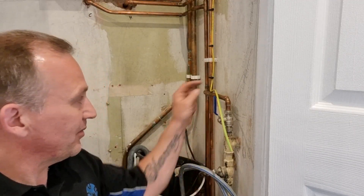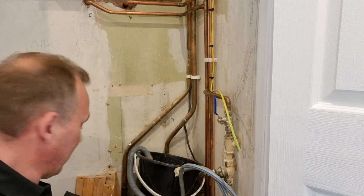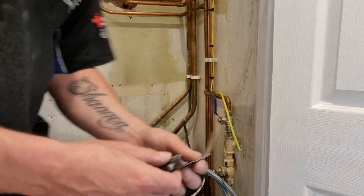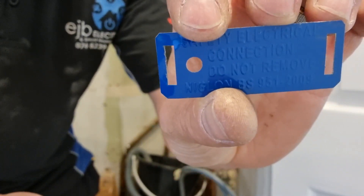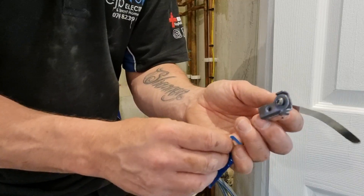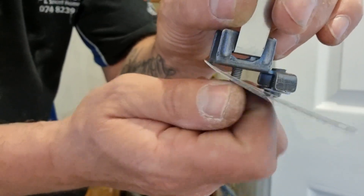I thought I'd share this as I'm in the cupboard upgrading the earth connections to the water and gas mains. I'll show you how I do my earth clamps, because not everybody would know how they go onto a pipe and how you connect them. So this is how they normally come in a packet. You keep the warning label on — it says 'Safety electrical connection — do not remove' — so that has to stay on it. You then take it out, put it through the ready-made hole, and do it up. You don't want the screw tightened so far that you can't see through the gap.